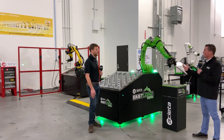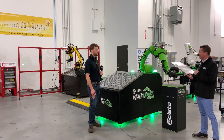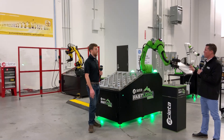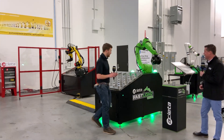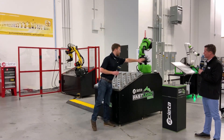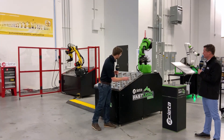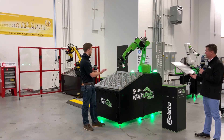That's great information. You quickly touched on return on investment, which these days we're all looking at — how quickly we can get our return. And you said there's no cell around it, so if I bump into this, I don't get injured, right? So it bumped into me right there. There are sensors in the robot that automatically stop it so it won't hurt anyone, and we have bumpers around the tool to make sure there are no sharp edges. Once it stops, press the resume button and it carries on from where it left off.